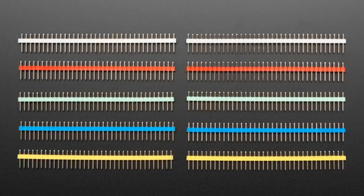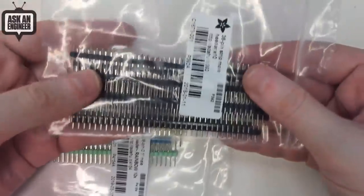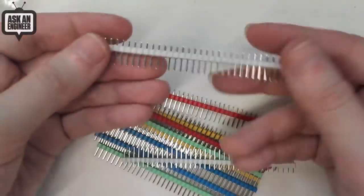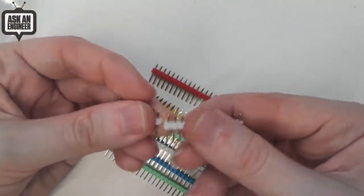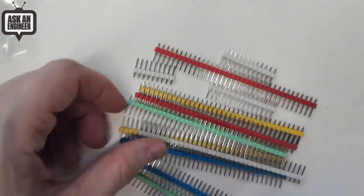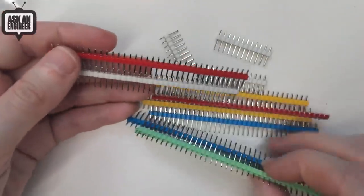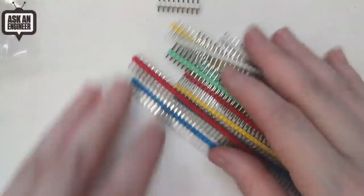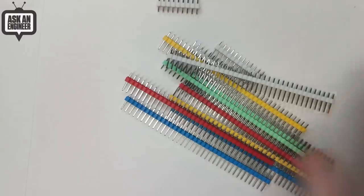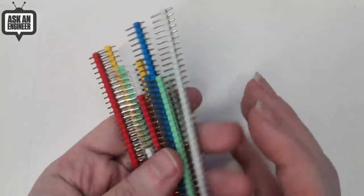I'll show the rainbow kit because that's the most fun. These are the standard headers that you know and love — they're break-apart. You get them in 36-pin long header bits, but you can very easily break them apart with your hands or with diagonal cutters into any length you like. The female headers don't break as easily, but you can with male headers. And we get red, white, yellow, green, blue. So if you want power pins to be red, data to be white and blue, and high voltage green — yellow means something else. They're the same price as the black header ones, just in multiple colors. So that's the male headers.